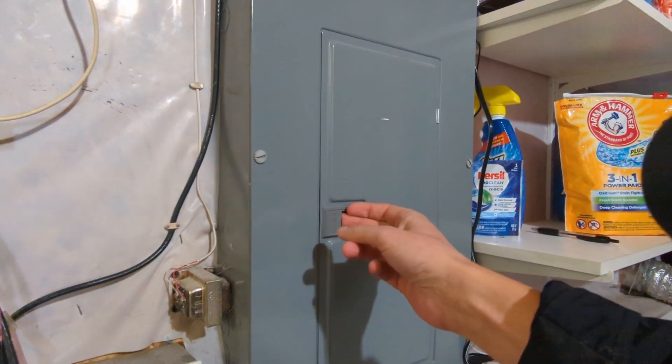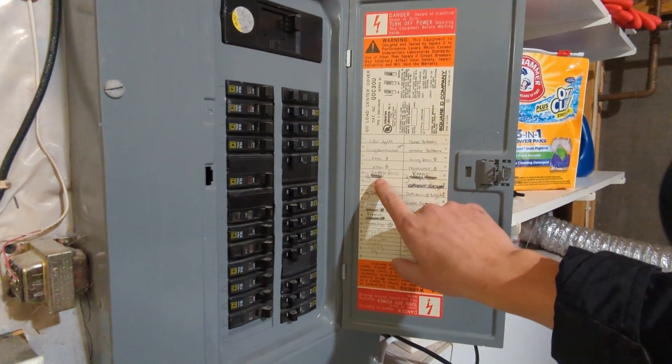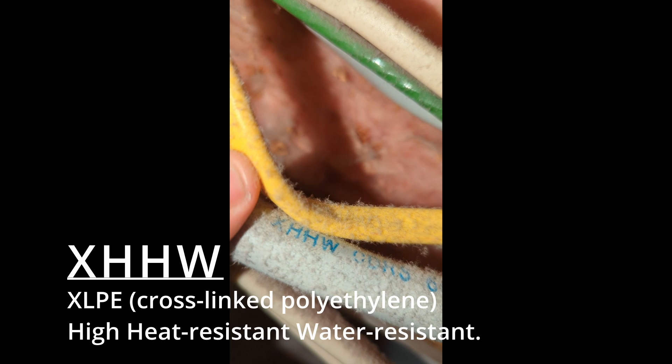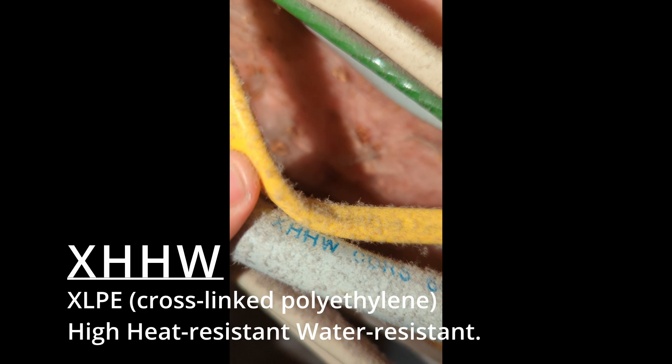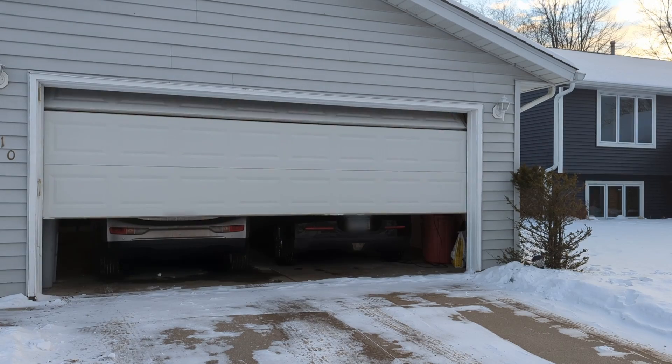The first thing we'll do is open the house main panel and locate the breaker for the circuit feeding the garage subpanel and shut it off. The service entrance cable running to my garage is 4-conductor, 6-gauge aluminum with XHHW insulation. An ampacity chart will show us that this cable is rated to handle 50 amps, which will be more than enough capacity for a 32-amp JuiceBox and a garage door opener with some lights on.